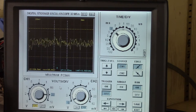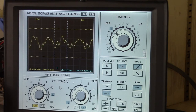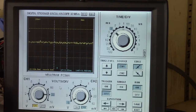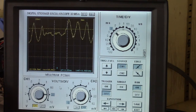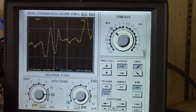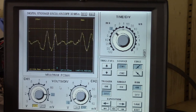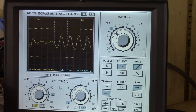And so anyhow, let's go ahead and put on the 1920s headsets and give that a comparison. So I'll undo these guys. Carefully hook up my headset. Now the one thing you'll really notice, it's really quite telling, is how much AC noise will be fed into this headset, because it's such high impedance. It's basically just not loading the circuit at all.